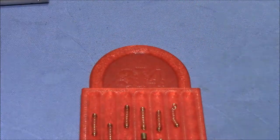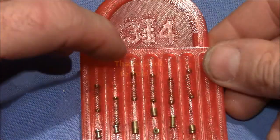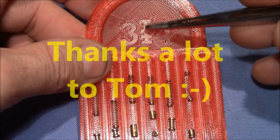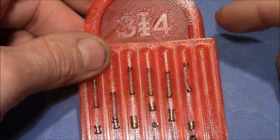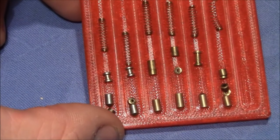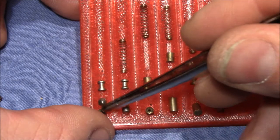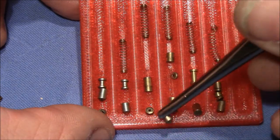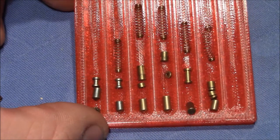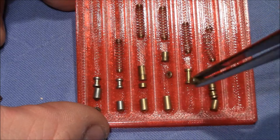So let's appreciate the nice pins in the very nice pinning tray. 3, 1, 4 with this wafer driver here as a one. Very nice. So here is the pinning. A lot of master wafers. Oh, today gutting is not the smoothest. You can see a lot of master wafers in here, and that's what makes this lock not too difficult to pick.